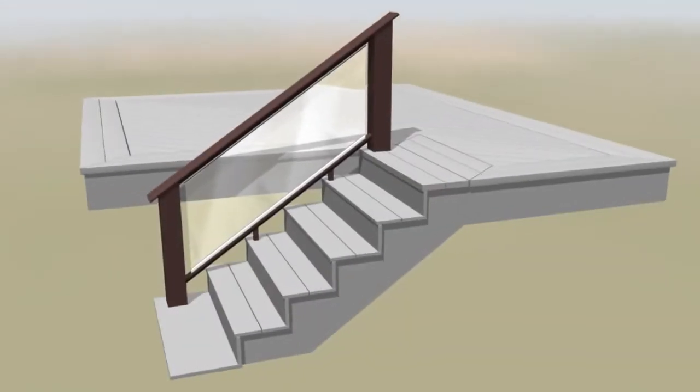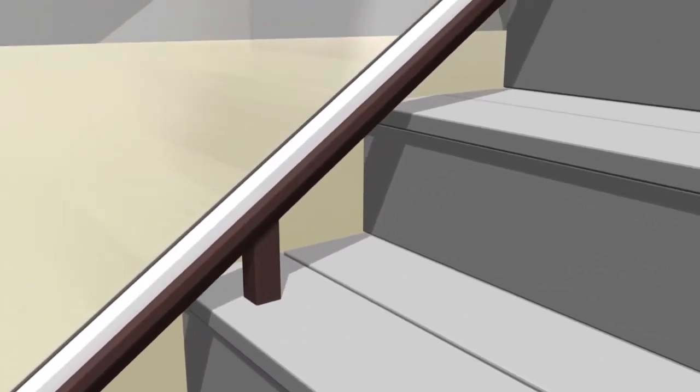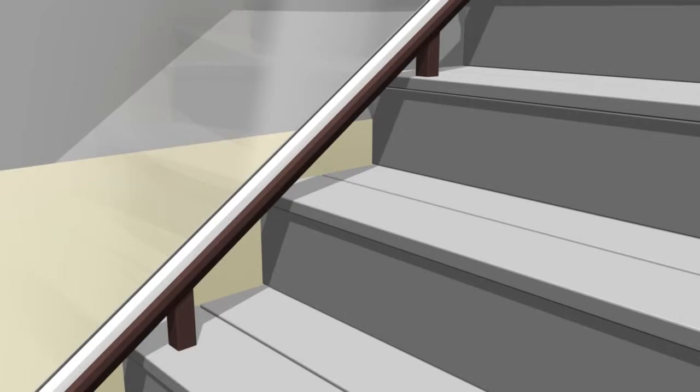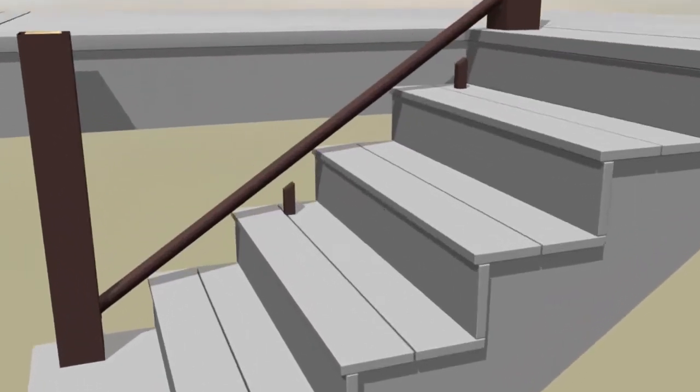Install foot blocks every 2 feet on center along the underside of the bottom universal rail. 2 foot blocks are required for every section up to 6 feet. Trim foot blocks to the stair angle. Prepare foot blocks by boring a 1/2 inch hole 2 1/2 inches deep, then follow with a 3/16 hole through the entire block.